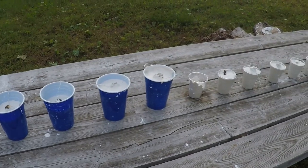I'm going to let them continue to set. Next step is to take them inside, remove the plastic or cardboard box from around the plaster of Paris mold, and then stick them in the oven. It's all an experiment — not really sure how high to set the temperature, but basically I have to remove all the moisture from the plaster of Paris and cook, burn, and turn the mushroom into ash to get rid of it. I'm probably going to set it fairly high and let it cook for a while, then maybe vacuum out the mushroom ash.